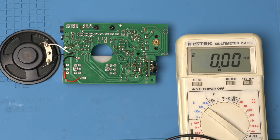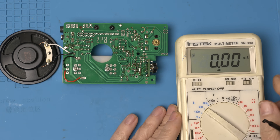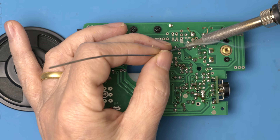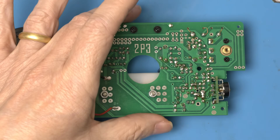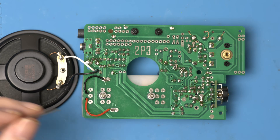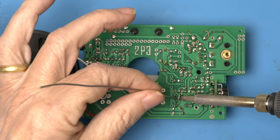The radio seems to be working correctly. Now we have to bridge these gaps that were put in to test the current. I cut off an old lead to help this along. That gap is easy to bridge. And finally IC3.